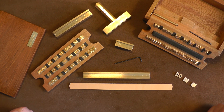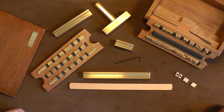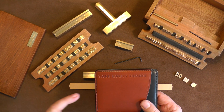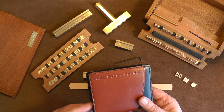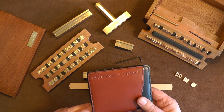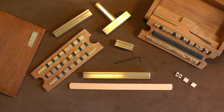The larger ones you can't use with the bar and hammer, so they'll have to go in the press. If you have an arbor press or a couple of G clamps that will work. You can see that you're not having to line everything up — it's all put into the bar and held in place. For something slightly longer you can put people's full names or full initials, add all sorts of detail, and you can see how straight, consistent, and even that is. Up until this point there was absolutely nothing that would let you do that at that calibre.